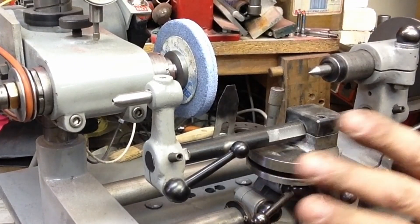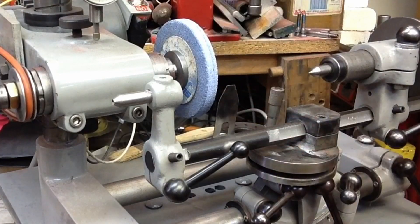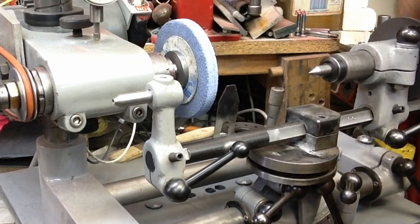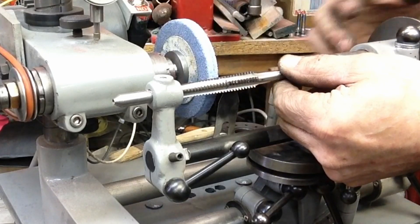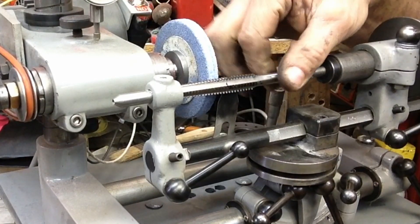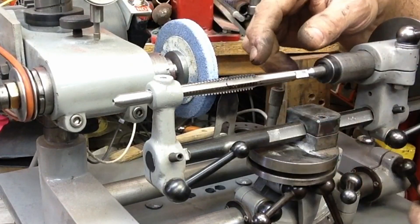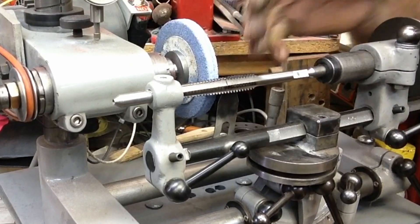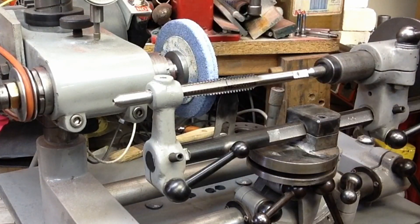Here's the setup for the cutter grinder — I've got my long bar on here with centers in it, for long reamers or similar work. This is the finger that the flutes rest against. I've already trued up the wheel and we're on center height. The tap sits in there like that, the back tooth rests on the finger, and the tailstock locks in place. When we grind, the cutter wheel goes counterclockwise, which holds downward pressure on the flutes. I had a dial indicator set up so we're running parallel and level — all within spec.